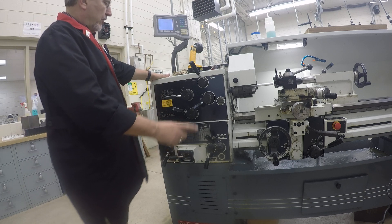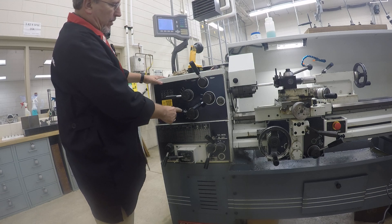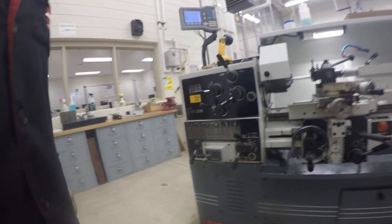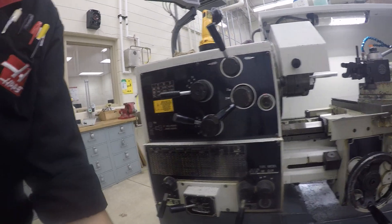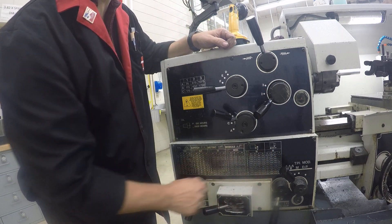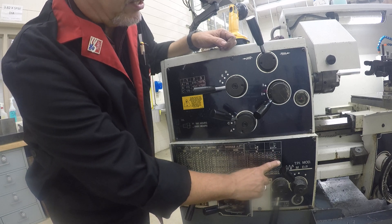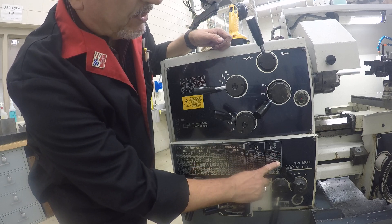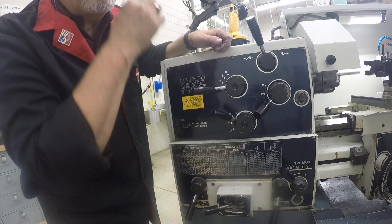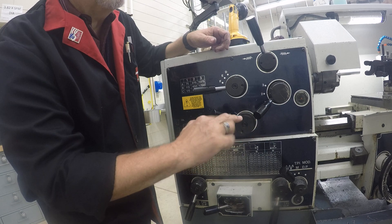First order of business, I'm going to look at my chart — 115 RPM in B1 is my recommended RPM. Then I'm going to look at my chart again. We're going longitudinally, so longways. I'm going to pick at least 0.017 inches per rev, so that's G4. I have gone faster but 17 is good.